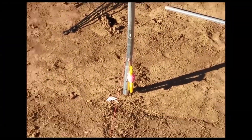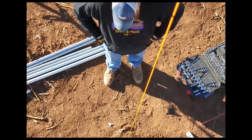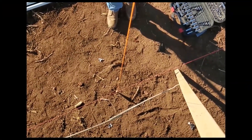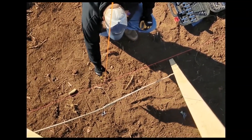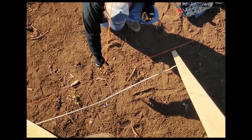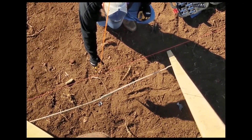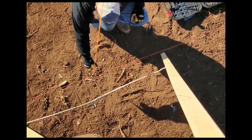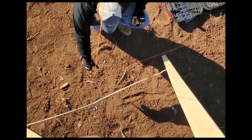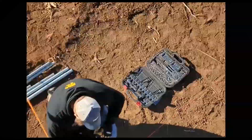What I'm going to do is pull up on this — it's on the outside of the bar — and Jared is going to balance it a little bit, keep it from moving too much. As we're doing that, we're adjusting the straps until that plumb bob is right over that string line, which means the very top outside of this rafter is flush with the outside of the bottom post. It looks like it's good to go, so these are all zipped in.